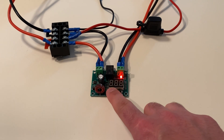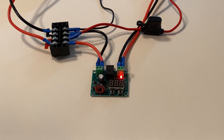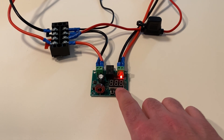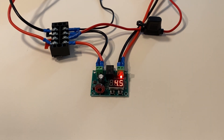Now we need to set the reconnect rate, which can be set at 1 volt under the total voltage. So for a 20-volt battery, we can set this at 19. But the way the board calculates the reconnect rate is by taking the low voltage cutoff, which we set at 14.5, plus the input that we're about to set. So we need to set the reconnect rate at 4.5 volts, because 14.5 plus 4.5 is 19, and this just means the board won't power back on until it receives at least 19 volts.